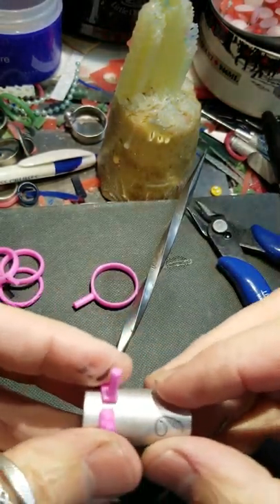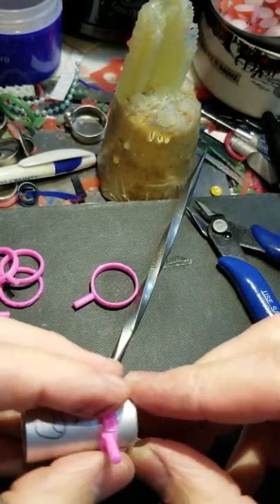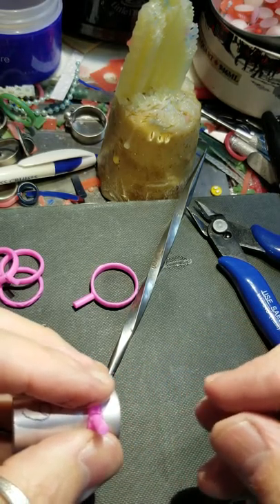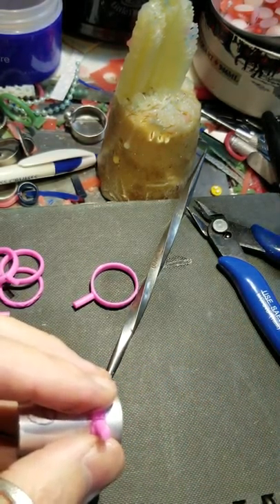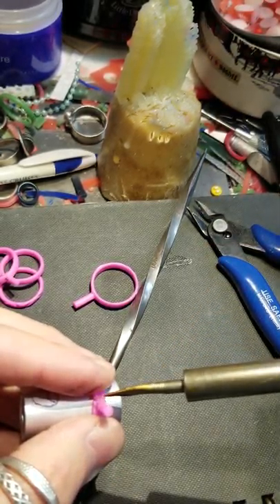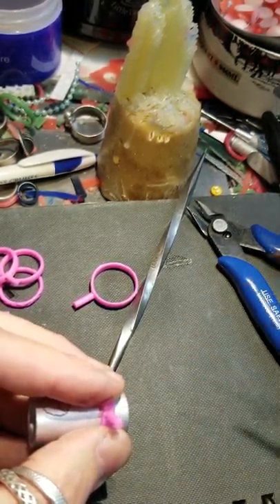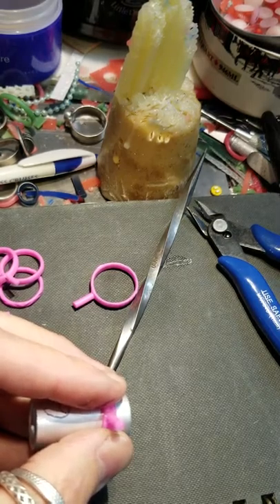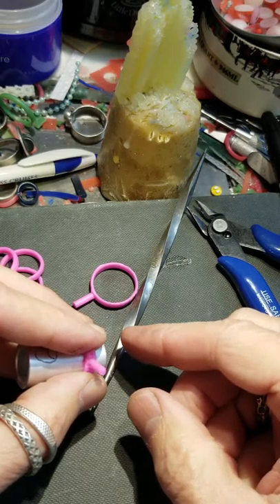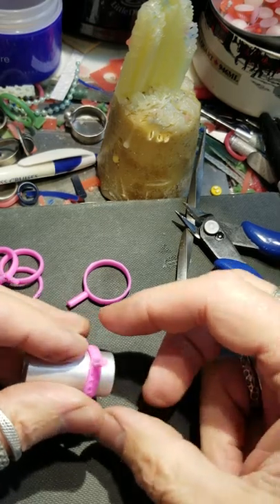Okay, so that's ready to go. Next step is I'm going to line it up — you just want to make sure the two sides are lined up as much as you can — and press down so it's flat on the bottom on the mandrel. I've got a little bit of sticky wax on there right now that's holding it in place. Wait five seconds or so, blow on it a little bit, then slip it off and move on to the next one.